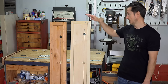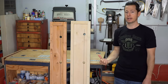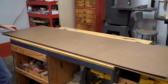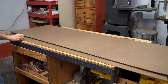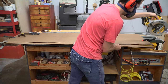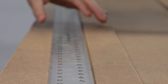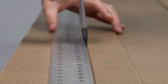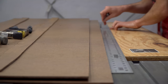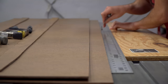Well I bought a new circular saw and I built this track for it, and in this video I'm going to show you how I added the plexiglass and why masonite didn't work out. The first thing I noticed with the masonite was that it was very flimsy, but I marked the factory edges anyway and cut off a few strips to see if they stayed straight. They were really bad, so I decided to check the edges of the wider pieces and they were also not great. I was detecting upwards of 1/32nd of an inch in variation with my feeler gauge, so I went back to plywood.